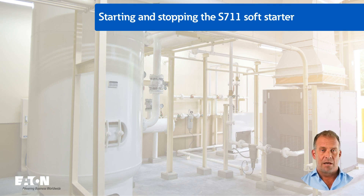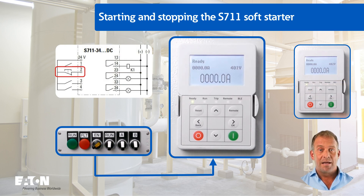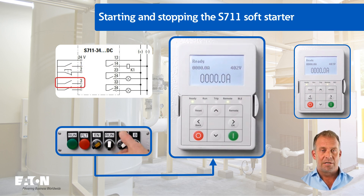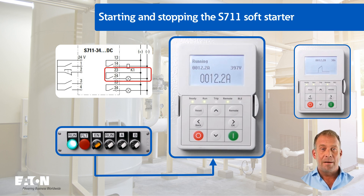The configuration is now demonstrated with a simulated load. The mains voltage is already applied to the device. Relay 13-14 has only a signalling function here. In terminal strip mode, the hardware is enabled at digital input 2 switch EN, and the ready LED is permanently lit. Digital input 3 switch A switches from local to remote, indicated by a steady light on the remote LED. Digital input 4, simulating the oil pressure sensor, is activated with switch B. When the start is enabled via digital input 1 run, the loaded motor starts to run up. Successful startup is indicated via relay K2 terminals 23 and 24. When the run command on digital input 1 is cancelled, the drive coasts to a stop and the time until the next possible start is displayed.